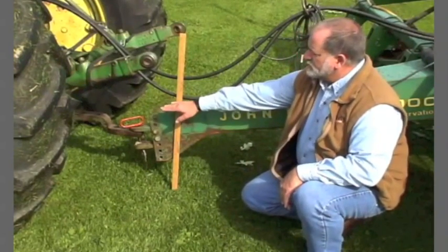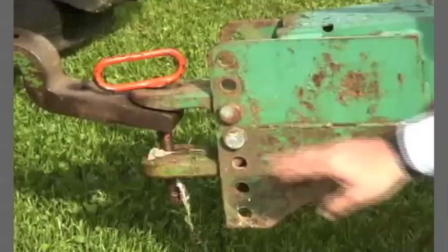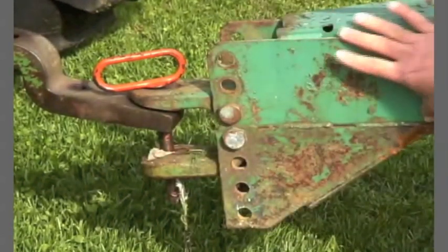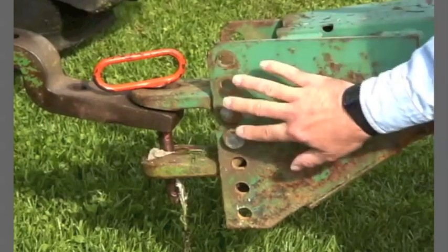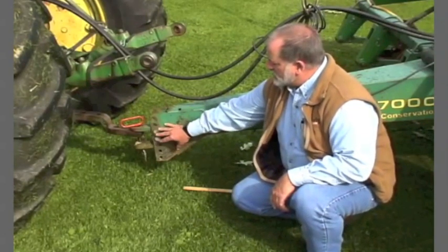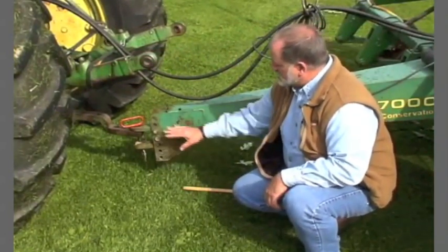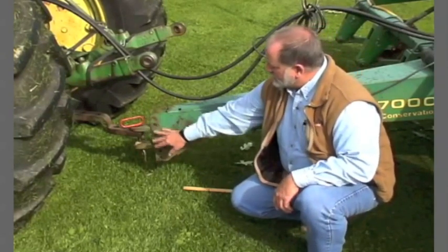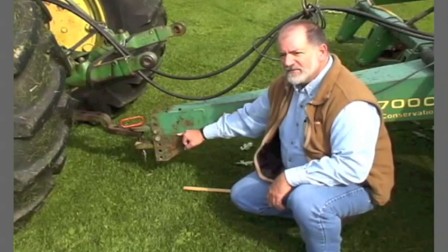You can have adjustments in the front. The tractor drawbar varies from tractor to tractor, and you can turn them up or down, flip them over. Some tractors you can't change the height of the drawbar, in which case you would use the holes here in the front of the hitch plate to adjust the hitch clevis on the planter — put it up or down until you get this height from the ground. You can also flip the hitch clevis over to give you an additional set of adjustments.